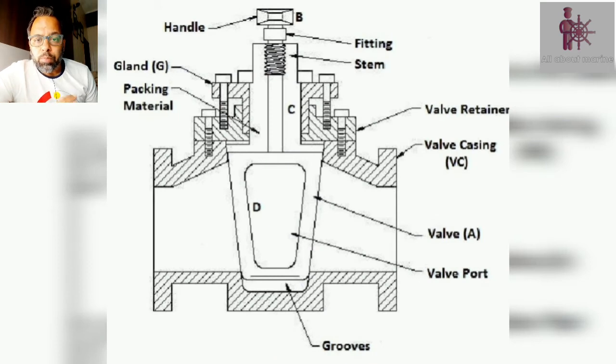The next is blow down valves. Normally the function of the blow down valves is to remove the sediments which are collected at the bottom of the boiler by periodically opening this valve and letting the water flow at high velocity, taking along the sediments. Also this valve is used to empty out the boiler in case we need to carry out any maintenance, cleaning, or we need to open it for inspection. When we open this valve, the water which is under high steam pressure rushes out and takes along all the sediments and impurities with it to the sea.